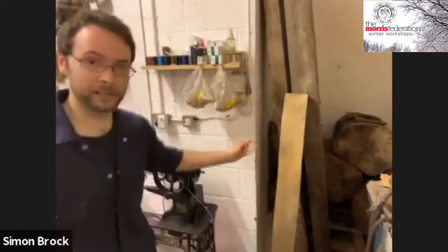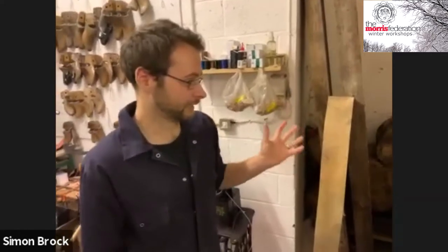The timber I use is sycamore. Historically, alder was used, and also ash has been used, particularly for step dancing clogs, because that's said to have a nice bright sound. And I do make the odd pair of ash soles, but 99% of the clogs I make are sycamore. Other timbers have been used in the past and continue to be used. So beech, for example, is used in machine-made soles. Alder, that I mentioned earlier on, is probably the best wood for if you're entirely carving the sole by hand, and more of that in due course.